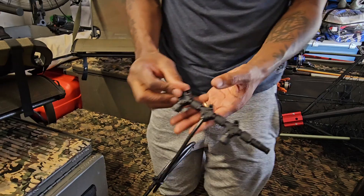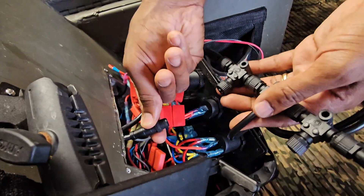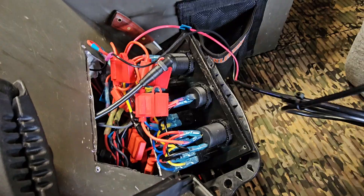This is called a backbone system. There are two other wires right here that go into that backbone system to make it complete. A lot of people hook up their power source for this NMEA setup directly to the battery. Well, I found out that it has a little bit of an amp draw, and over time it will run your battery down if you're storing it for long periods. I don't want that issue. I want to be able to control it myself, so I hooked it up to my actual switch panel. All you have to do is just run your negative — extend that negative from the three-foot NMEA power line that they give you — extend it to your battery wherever it is on your boat.